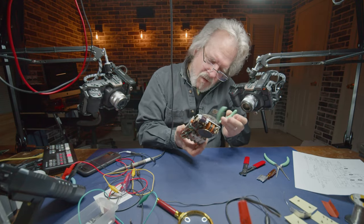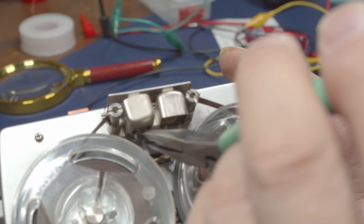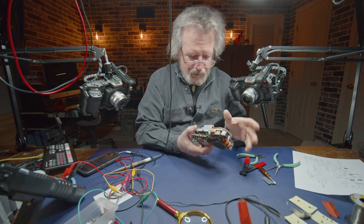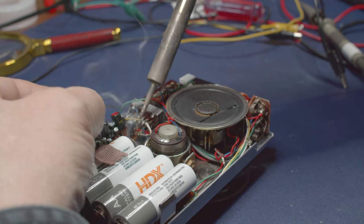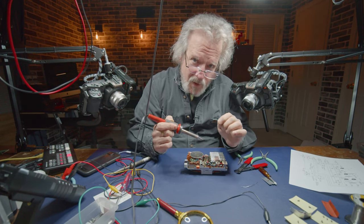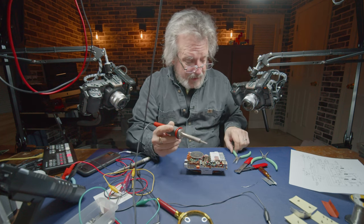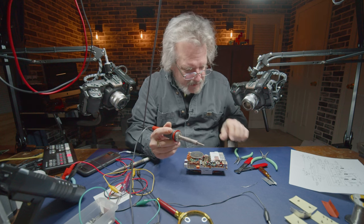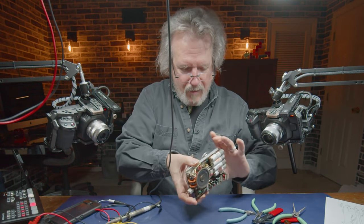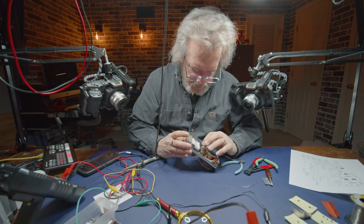Making sure I haven't done anything to the tape head on this side - it did pull the wire a little bit so I'll pull some back. I'm going to flow some solder onto the tip of the iron with the wire on top - sneak the tip of the iron up underneath the wire, touch the iron with the solder, and it'll flow onto the wire. Just the tiniest little dollop of solder. This should actually have audio from the tape now.